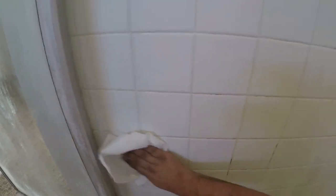I have not acid-etched it yet — I'm still cleaning. One thing I like to do throughout the process is take some paper towel and wipe it down, because the tile should be smooth and slippery. With the paper towel I'm able to feel any spots that are a little bit rough, which tells me there's soap scum still there. I'm wiping it down, drying it a little bit, and also feeling areas that still have soap scum. Here I'm just removing any loose or nasty caulking — you can check out one of my other videos where I specifically go over how to remove and re-caulk around a bathtub.